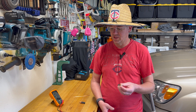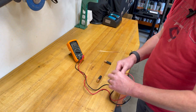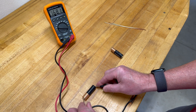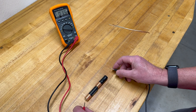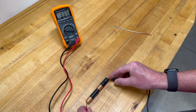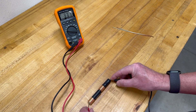To understand that, we need to understand one principle if we're going to combine multiple panels — that panel supplies power to the circuit. We're going to talk about a battery and the difference of parallel versus series. I'm going to use a multimeter to demonstrate this. If I take one battery rated at 1.5 volts and put it on the meter, you'll see it's going to be a little above that — 1.68 — because it's a brand new battery. And if I connect two batteries in series, which connects the plus on one battery to the negative on the other, you can see it has doubled the voltage. That is basically series: we are doubling the voltage without changing the amperage.